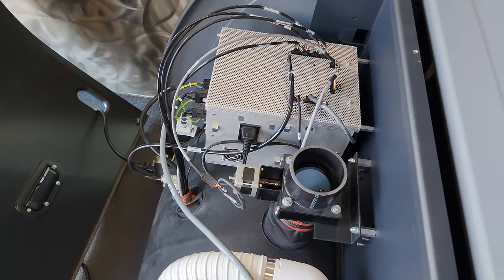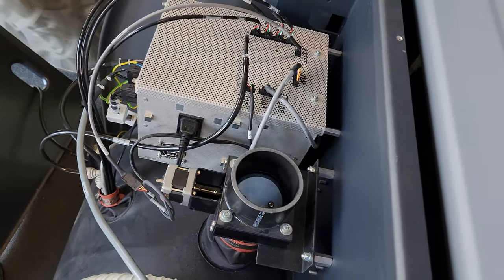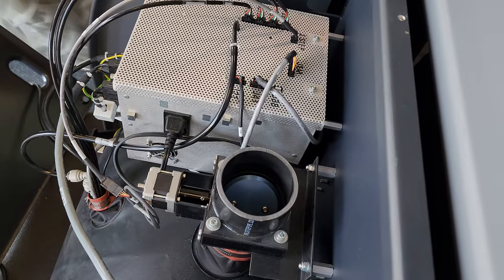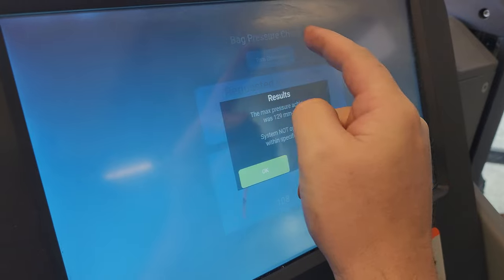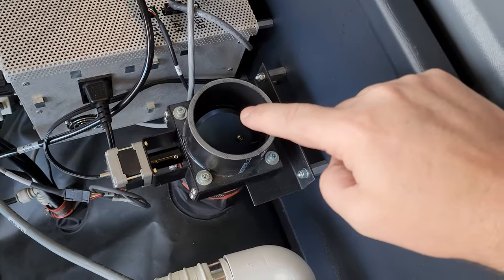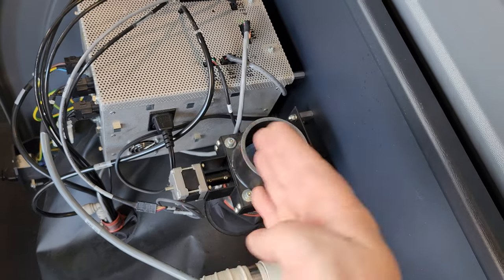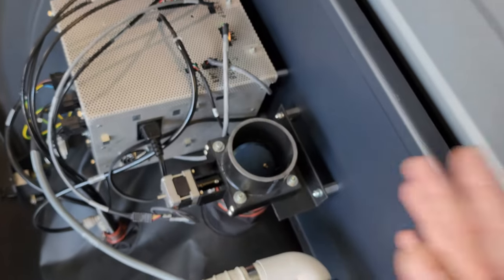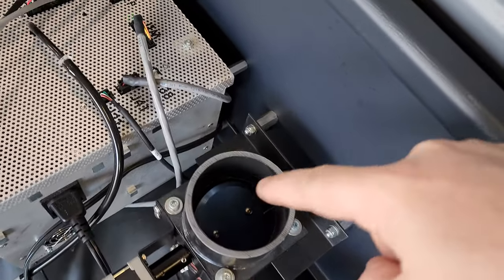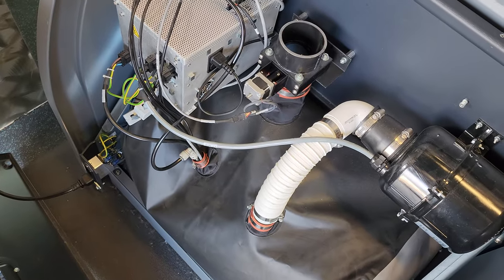Right here is the baffle. I'm going to give it a push right here and watch the baffle — I'm going to over-pressure the system. What I was doing is over-pressuring it: it opens up the butterfly valve and then closes immediately so it can take a quick measurement — that's how it does it. It goes open, close, then it floats, and then you over-pressure it again, it goes open, close, and then it measures. Pretty neat system, pretty easy. You can see right now the baffle is 20 to 30% open. That allows me to deflate the bladder down here. And once it's deflated, we can adjust the height again and take it back so that it can be ready for a patient.